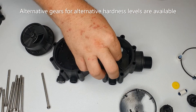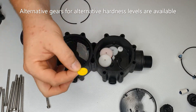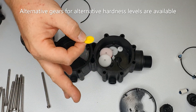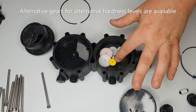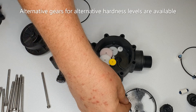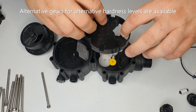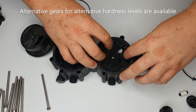Lastly, put the pinion gear in, which is the main turning one. This one sits in an A, B, C, or D position and determines how many liters of water the softener will produce before it swaps over to the second tank. You would need to move it between A, B, C, and D depending on size. If you're not sure, drop us an email. These all come as a kit — the link will be in the description below.